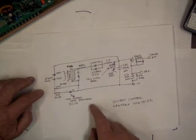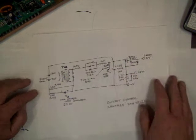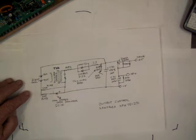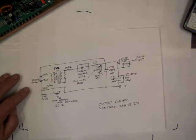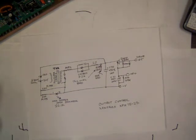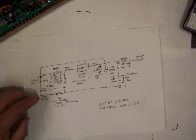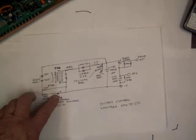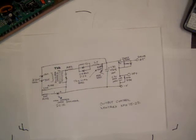And when I turned the thing off, of course I found this capacitor shorted, and then these two resistors, the 220 ohm, quarter-watt resistors, were both open, which really shocked me because I've had quarter-watt resistors turn red for a couple minutes and the resistance doesn't change more than 2%. And these things failed immediately. They failed so fast, they protected the opto-isolator diode. I mean, that was kind of amazing.